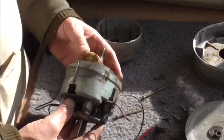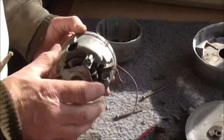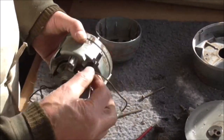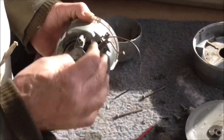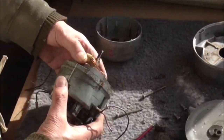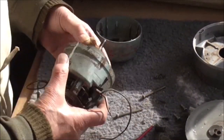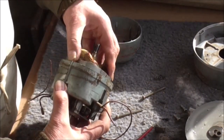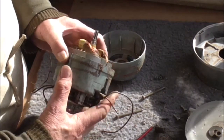I put the armature into the motor casing with the new bearing and I've also put the field coils in, but they're not fixed. I put the wires through there - it was a bit of a fiddle so I didn't bother filming that bit. What it does show is the importance of marking, like I showed you earlier, how to put a line on to mark the position of the field coils in the end cap.